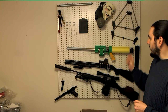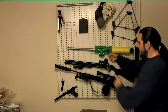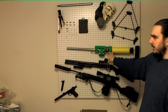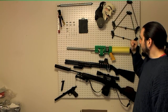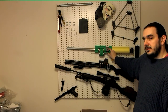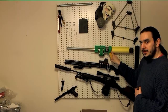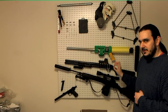So I have two competing ideas. One is to have some kind of lever where you push down with your thumb and that actually actuates a lever or rod and forces the firing pin back into firing position. I like that idea - it's really elegant. But it's going to be hard. It has to be light enough for your thumb to push, but strong enough to push back that whole firing pin with spring. We can take some mechanical advantage, but I'm not sure what that looks like inside of here right now.